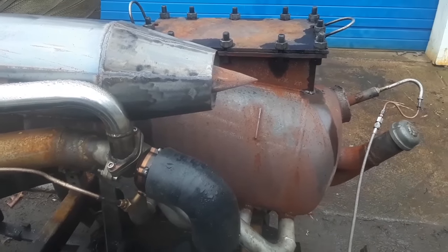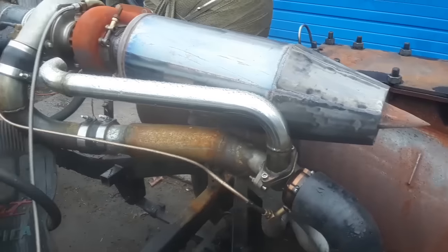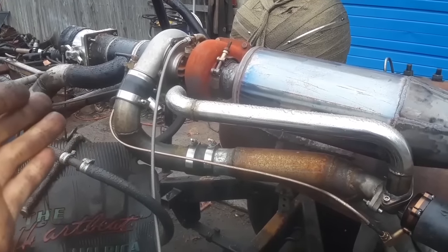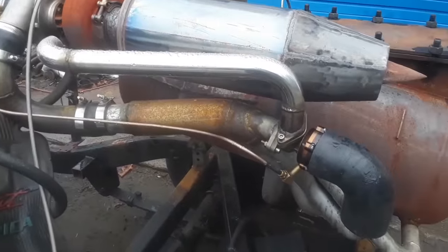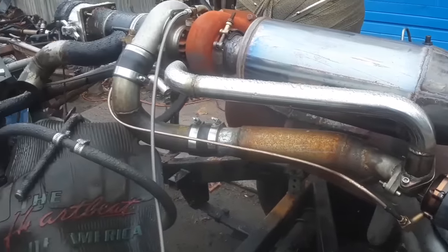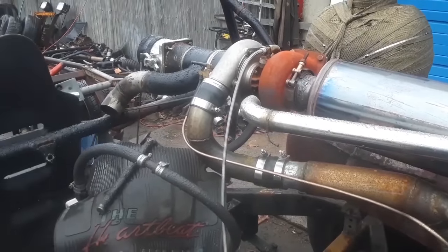the oil run, if you will, running it on the oil itself, no firewood. You're going to see me playing with the wastegate because 25 pounds of fuel pressure is still too much for an idle state on this thing, but when it's cranked up and spooling like crazy, it takes the fuel. It doesn't backfire with all this fuel, which is kind of interesting.